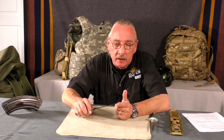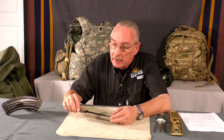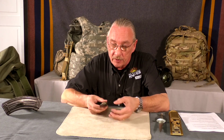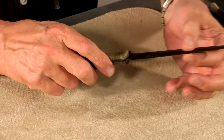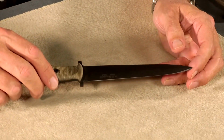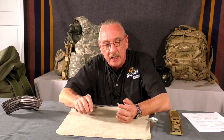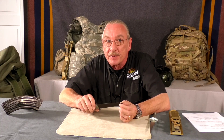As with the other knives in the Sandbox series, we elected to use DM1, a very tough steel designed by Dan Maragni, a very talented metallurgist and knife maker. And it is a high carbon steel, so you will want to protect the edge with some rust-free. The heat treating of the blade is overseen by Dan Maragni himself. We actually went to the extreme measures of rebuilding the salt baths and quench tanks to optimize the heat treatment of these to ensure that we maintain the 58 to 59 Rockwell that yields the toughest performance for this material.